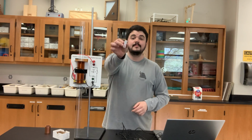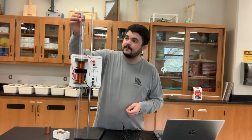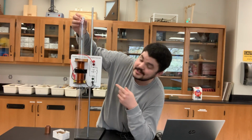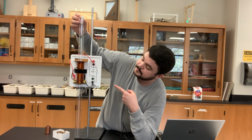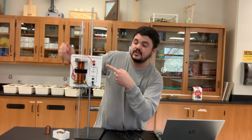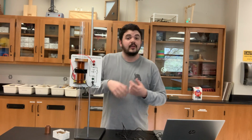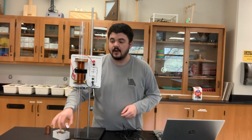So far, it hasn't mattered if we go north first or south first. But if we go north first here, we can watch, and again, I'll do this in high speed in a separate video, but we can see that the order differs. The red turned on first, and then the green. That corresponds to current going in one direction around the coils of that wire.